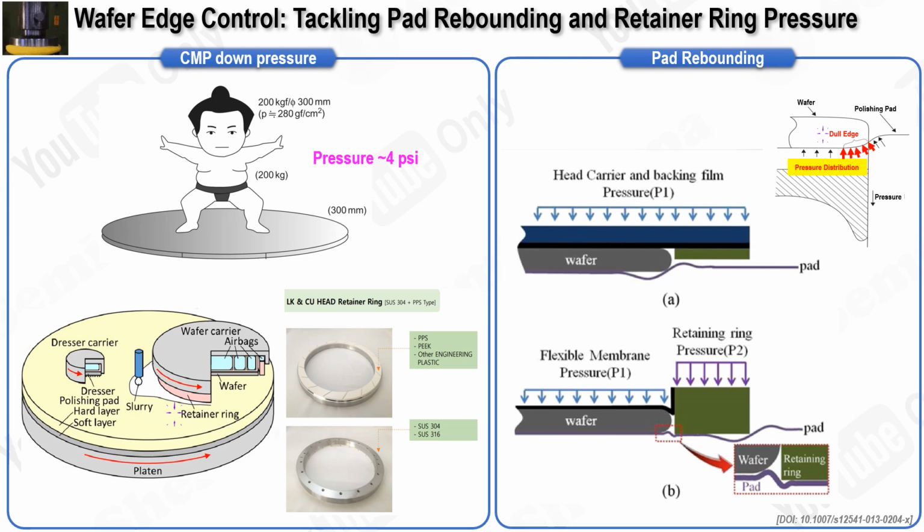It requires careful consideration of both pad rebounding and the step height caused by the wafer edge exclusion. These factors together create challenges in controlling the CMP process and ensuring uniform material removal, especially at the wafer edges